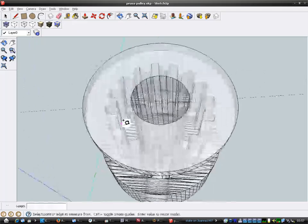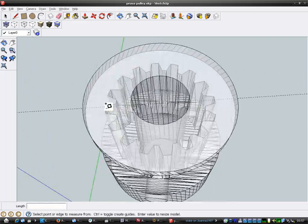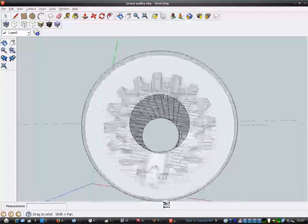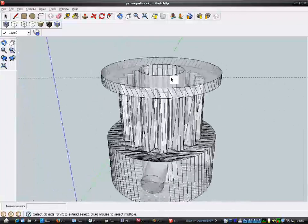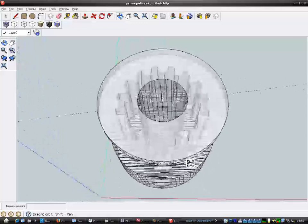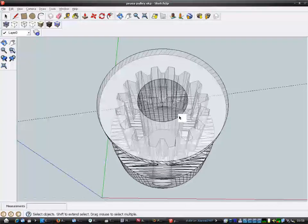If the teeth are too close together, if they're a shorter distance apart, everything you print would be too small. So let's say I'm printing a 10mm wide object, it would probably come out at 8mm, depending on how far the cogs are apart. So you can't have that. You've got to have the right gear ratio, otherwise it messes up everything in the firmware. I've been trying my best to find the right cogs, and I think I found the one in China, and I've ordered them anyway, and I'm waiting for them.